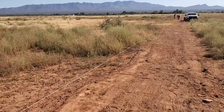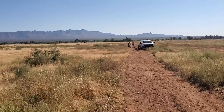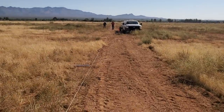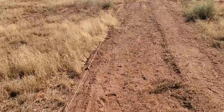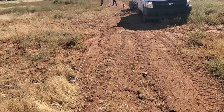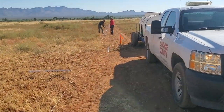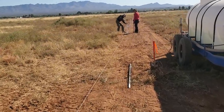So we stretched this poly braid — that's our straight line. If you were a carpenter, you'd look at that like a chalk line: you snap that on a piece of board, it leaves a chalk line, that's where you cut your board. Well here we're using it to drive our posts. We're not going to get it like a laser laid it out, but this water line — before we started, they had a surveyor crew come out here and put these markers up. So we know exactly where the center of the farm is. They flagged it every 500 feet, so we were able to take the trencher and say, follow the flags and you'll be good.